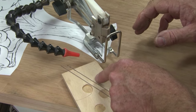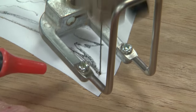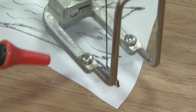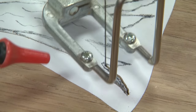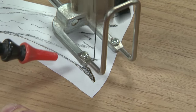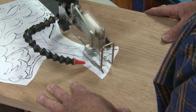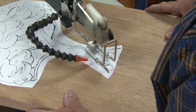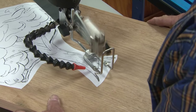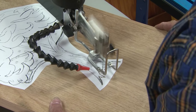The neat thing about a spiral blade: it lets you use every side of that blade to make the cut. We continue to go in a counterclockwise direction, taking our time. If I do make a mistake, I just keep going because no one will ever see it. I just use this technique right here to outsmart the scroll saw so I can use whatever size material I want and the throat does not get in the way. I can swing it around and just use the side of the blade.